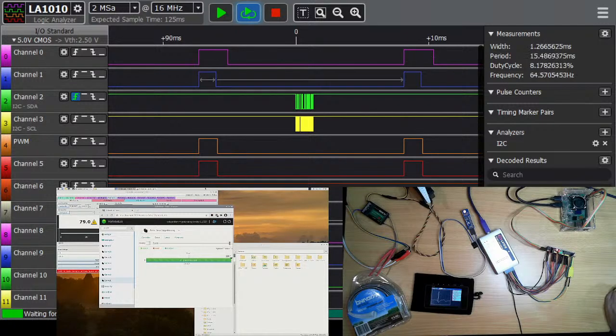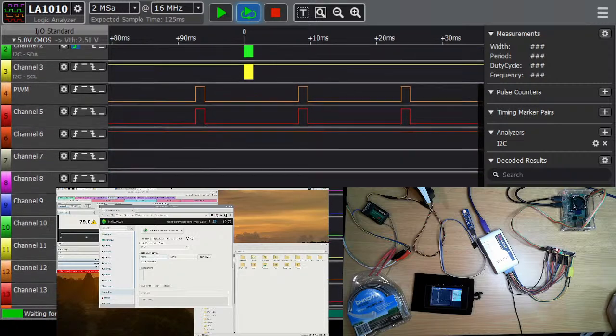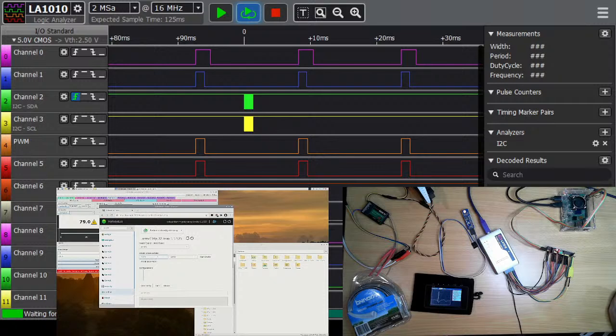Now the testing I was doing just the other day was showing a slightly wider range than that. I was using a different version of my robot lab, though. So I've got 7 servos created so far. None of the other channels appear to be active at all. I have had that error before, and I think it was an initialization error in 1.1.523, where previously to running that version, I'd run the I2C bus, or run that servo with another variant. Then when I fired it up, I got an unexpected movement on a channel I hadn't turned on yet.